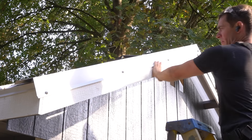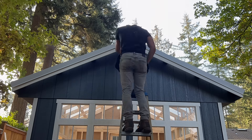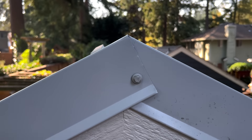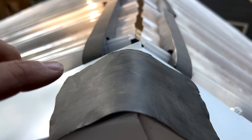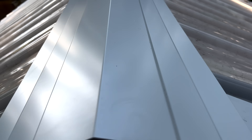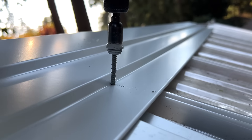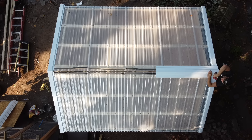As far as alignment goes, the most important thing is the very tip top alignment. I'm making sure that the very top edge of this flashing is aligned perfectly with the very top point of our eave. But there's still a seam right there that I need to take care of, which is why I'm using a membrane flashing at the very top to make sure there's no possible chance of any moisture getting through at this location. Our final piece of trim on this roof system is this top cap, which is nicely placed right on top and comes with specific screws that are a bit longer than the ones used previously. This accounts for the more sizable gap we see at this location.